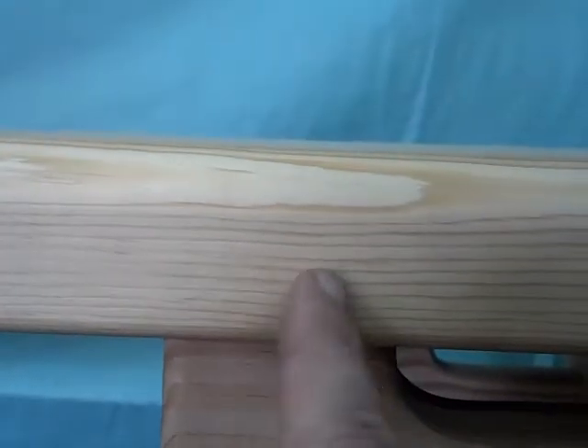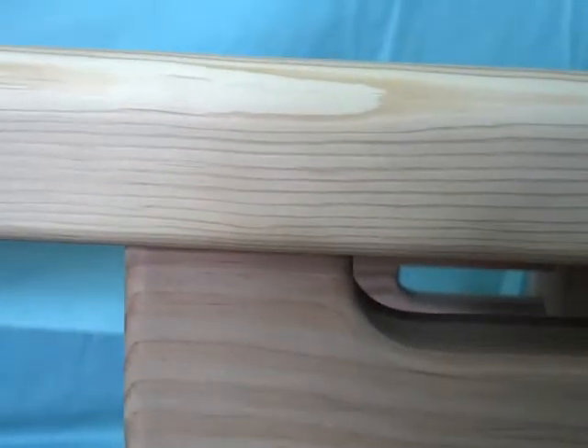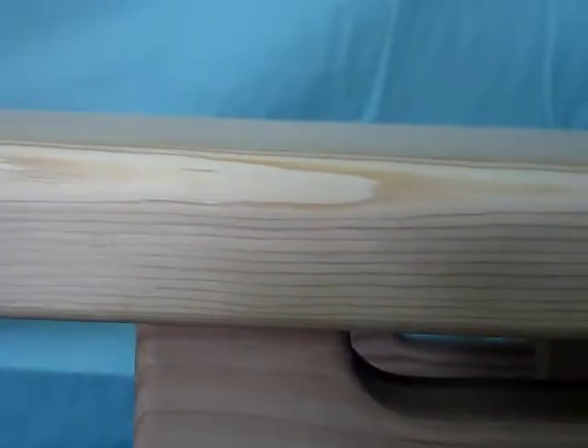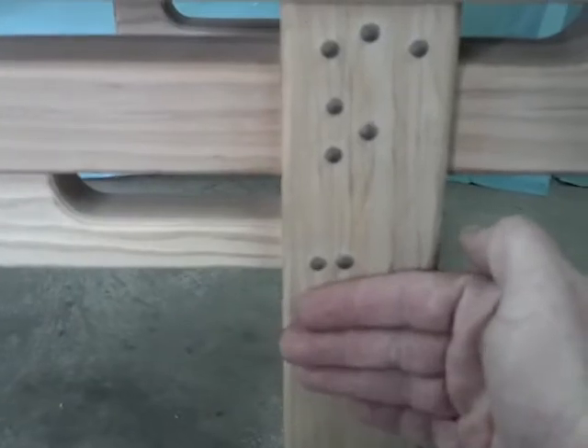The mortise and tenon here is to stop the racking forces and to create alignment once the top is joined back into the piece. The tenons aren't very tall through here at all. This all combines for a very sturdy, long-lasting bench.